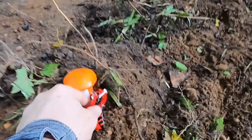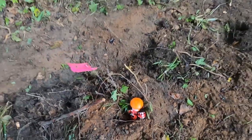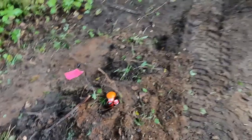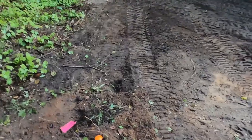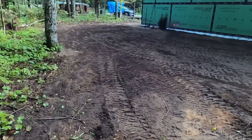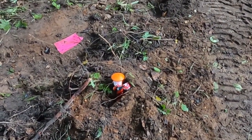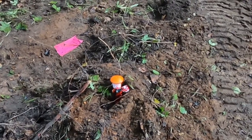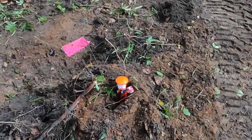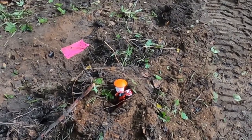About 1 foot down, we put some tape that just says electrical line. If anyone in the future ever happens to dig here, they'll hit that tape well before they hit the conduit. And if they get a metal detector back here, they can plot out exactly where that conduit is. Down here, I stuck a piece of rebar in there with a cap on it, just to mark that spot. I'm not sure when we're gonna get to the solar. I'd hoped to do it this summer, but summer is waning, and who knows when we'll get to it now.